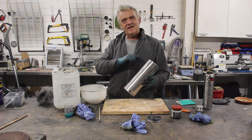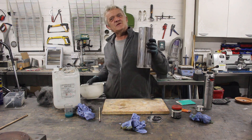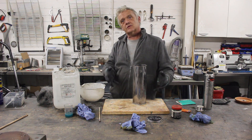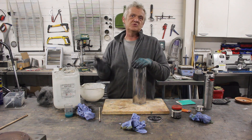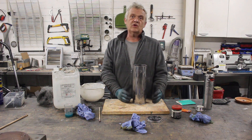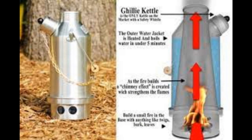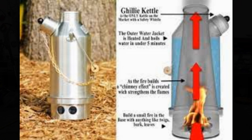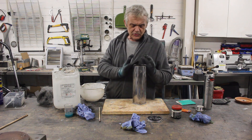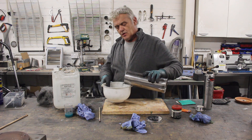When you've done that, give it a clean because you've just put some acid on there, and what you end up with is a water-tight tank joint. The solder can't get back to its melting temperature once we've got water in there — it'll only get to 100 degrees, and that solder melts at 200–300 degrees centigrade depending on the type you use. So we have ourselves a water-tight container in which we can boil water, which is really handy because I plan on making a Kelly kettle to put on the rocket stove from video 1726 — making a rocket kettle. That's the overall objective, but I wanted to show you how to solder stainless steel first.